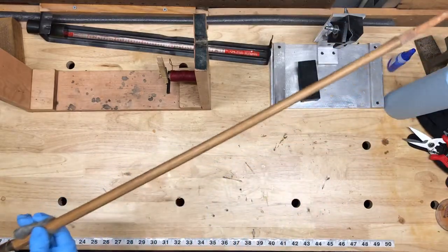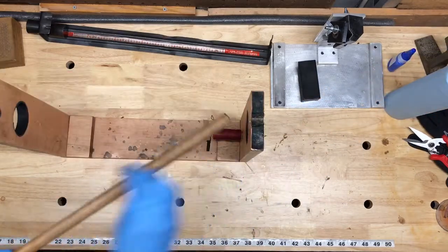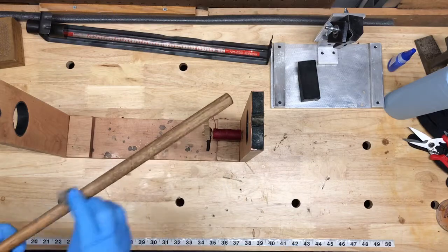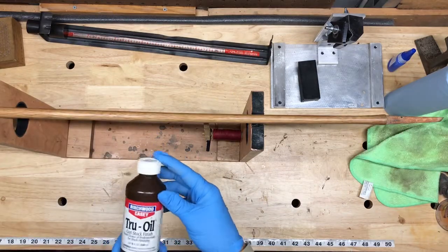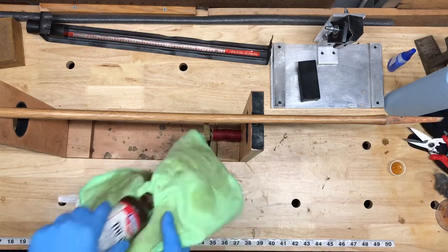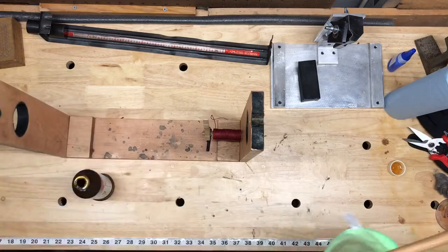So that it can receive either the linseed oil or the shellac. I'll spend a little extra time under the grip because there's usually some residual fibers here that need to be removed. I'll show you how to use the true oil first — this is pretty self-explanatory, a little bit goes a long way, and I'm using a microfiber cloth to apply it.